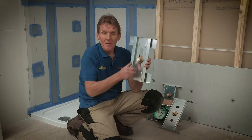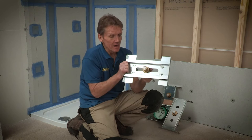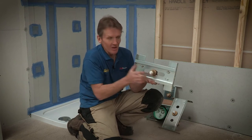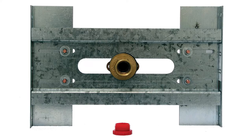And finally, of course, you get bath mixer spouts, and they're also problematic to mount on stud work. So again, a variation on that shower head plate is this one, which allows you to put the bath mixer spout in nice and securely — solid as anything. So if the kids start hanging on it and playing around, it's got a really good firm fixing.